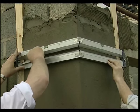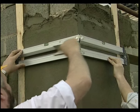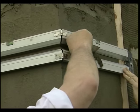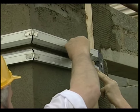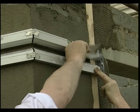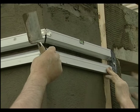With a special 70 degree trowel, simply cut out the groove approximately 12mm deep. This leaves 6mm of plaster for a perfect finish. PlasterMate can easily be adjusted to cut grooves of different widths.